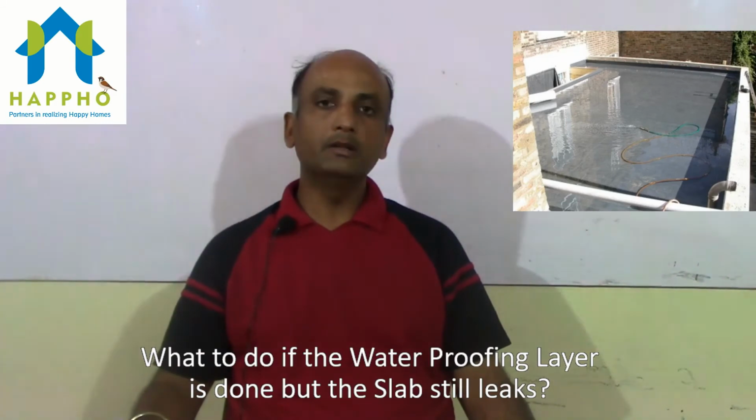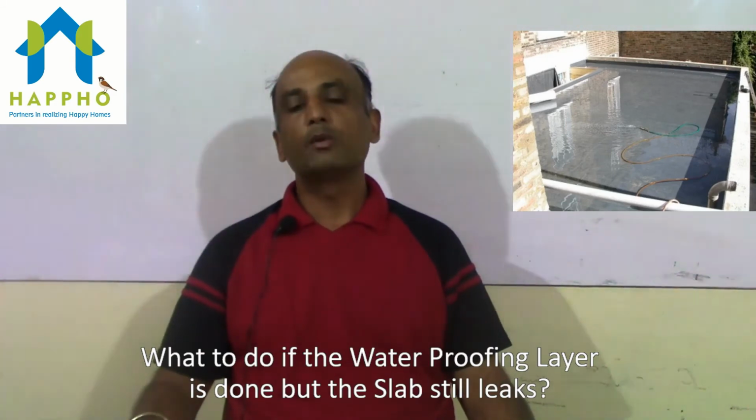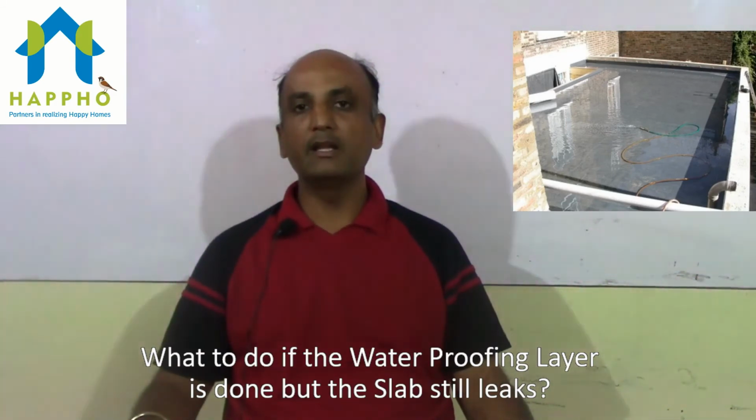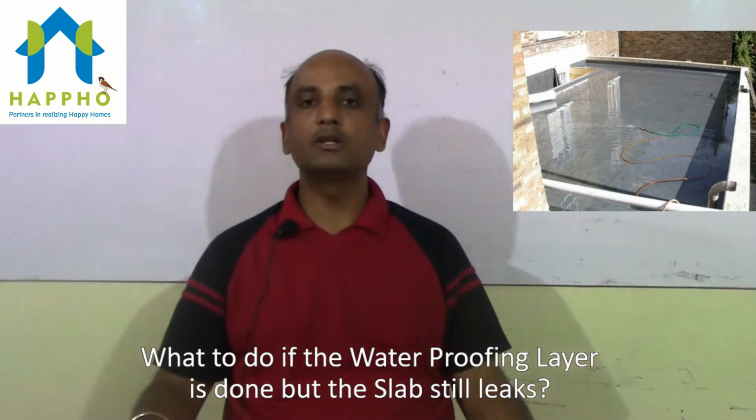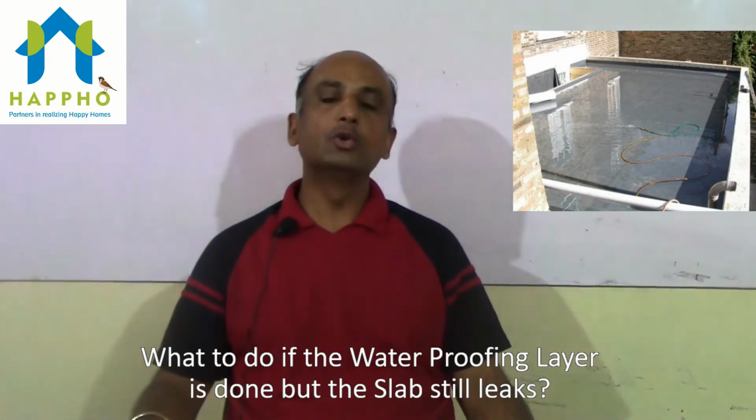On the repair work done, you need to do a water ponding test. Water ponding test, as mentioned earlier, you need to fill the entire slab with 1 or 2 inches of water for 72 hours. Post this water ponding test, look for dampness signs beneath the slab.